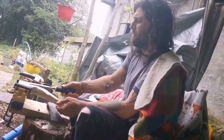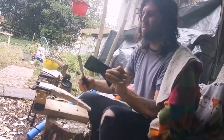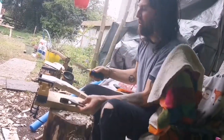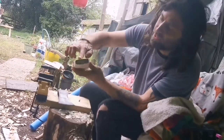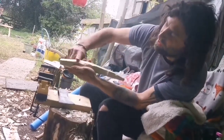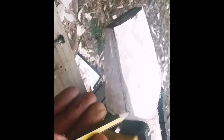Use the vise as a bit of a level so that I know I can get it square to go down inside of the shaft. So I'm just planing it down to where those lines are that are left, and I can see where I'm going back there. This is where I need to get it to come level right down. We just take that, guess it at whatever's level, as long as it's above rather than below. And I'll just start planing that bit off now.